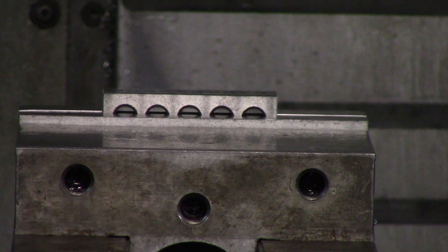When touching off with a piece of paper, remember the thickness of your paper. You can always mic it, because whenever we touch off with a piece of paper we're also going to drop that thickness. A lot of people forget to do that and their part will be four or five thou big because they forget that paper actually has an existing thickness to it. But it's a quick way to touch off your tools, especially if you only have two or three of them.